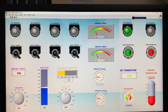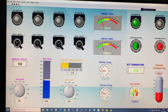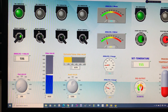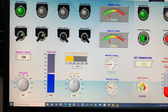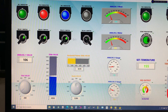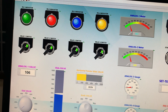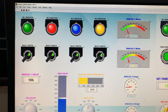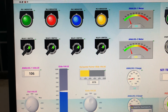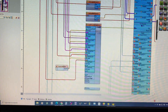This is the complete SCADA system. Not only two monitors — I can use many monitors: two, three, four — no problem. I can use it from different places as well. However, when you increase the number of clients for the same controller, the response speed will decrease, but it will still work.